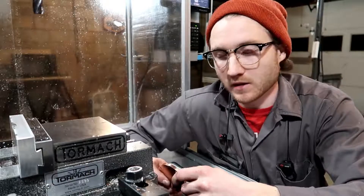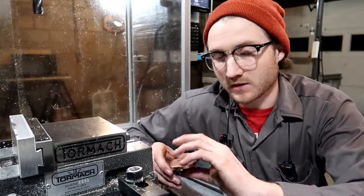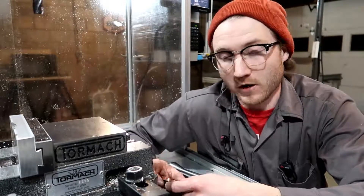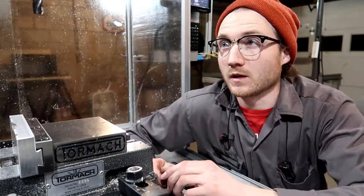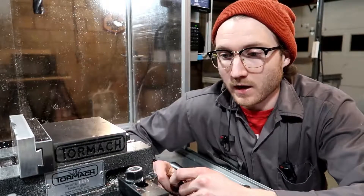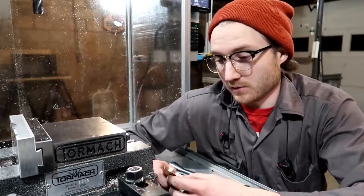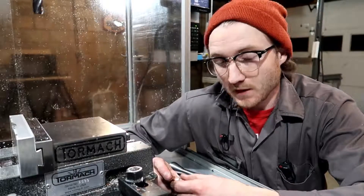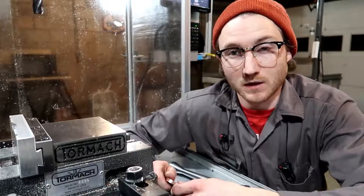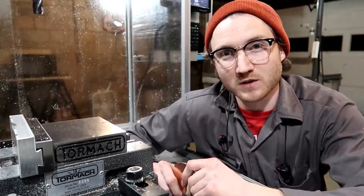After the first big pass of the adaptive clearing that I did — when I cleared everything out on the first operation — I noticed that the part was decently hot. I ended up going the same rates as I do with aluminum everywhere else though. I sort of went conservative to start just because I haven't machined the metal before, and after that I just went full bore and treated it like aluminum, and it seemed to work out okay. I just bumped up the coolant on the mister, and that seemed to help things a lot. It turned out alright I think. So I think that's it for now. Thanks for watching.